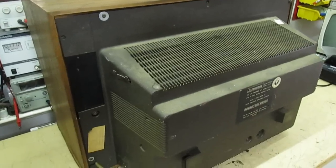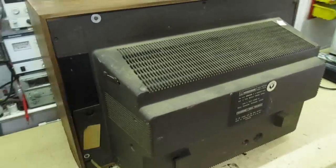My friend says this was working when it was laid up, but obviously after 25 years there's bound to be something wrong with it now. On the top there's a little sticker - let's have a look - it says A51 120X, so that's the tube. It says the tube's been replaced, and also the EHT tray and the line output transformer have been replaced.